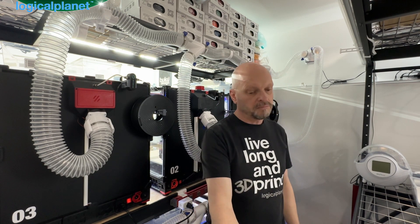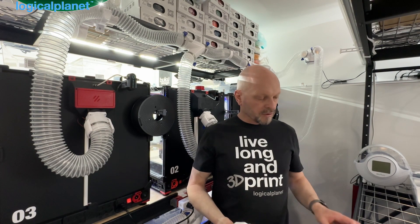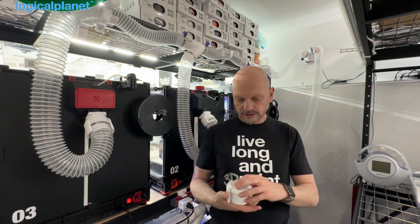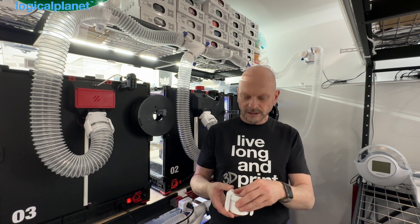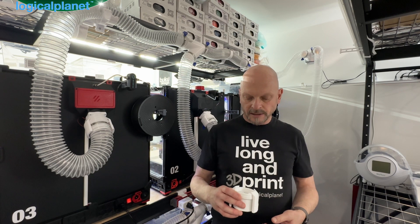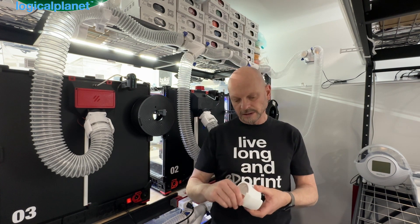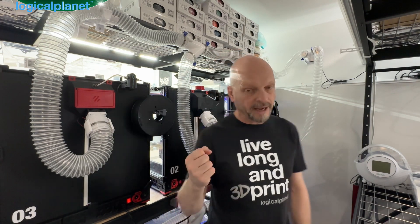When I tried gluing it, it was so successfully done with the PETG that I didn't see any reason to undo that strategy. So everything prints independently with no support except for the head itself. The support structure prints inside the head and supports these teeth so you get a really clean sharp edge that's overhanging parallel to the print bed. When done, you just have to pop that out — you might need a knife to clean it up a little — to get a very sharp edge, which is critical for getting a really good bite against the accessory.